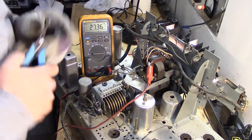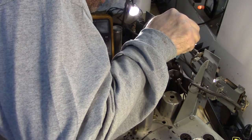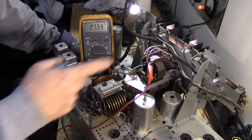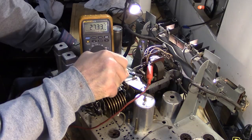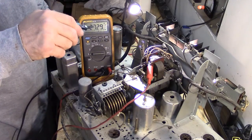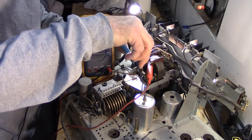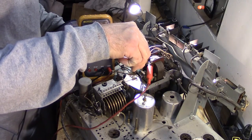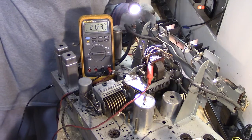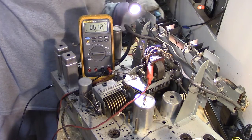Okay, so one of the things it does do, that I'm just now realizing, is that once it reaches the end, the motor will slide, the armature on the thing slides back and forth. And so if you look right here, you can see the end of the armature shaft. It will slide back and forth. And I learned this one time. I was looking at one of these to buy, and he said it worked, and it appeared to be stuck. But I remember having read something about it. And I was able to get a long-nose pliers in there and pull this shaft out. And when that shaft is out, it disengages a stop switch. So now, there's a reversing switch, though. I forgot about that.